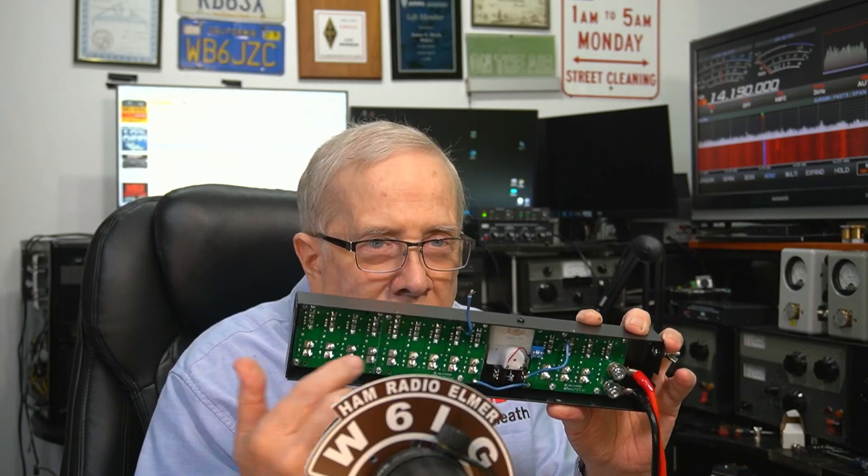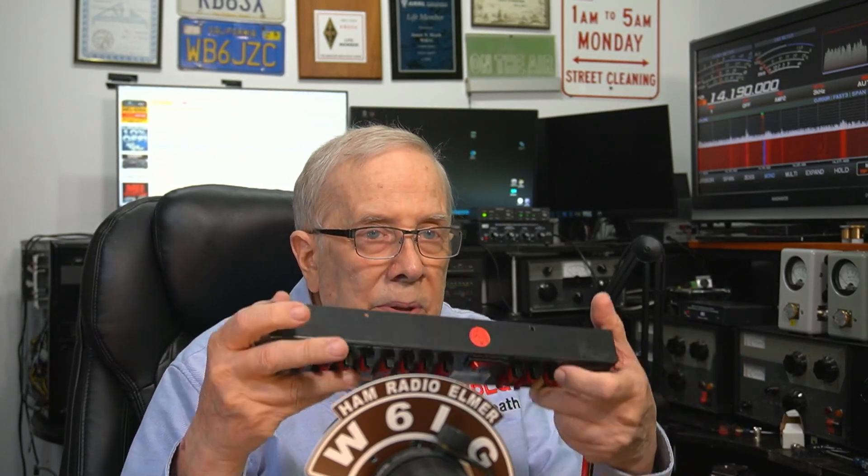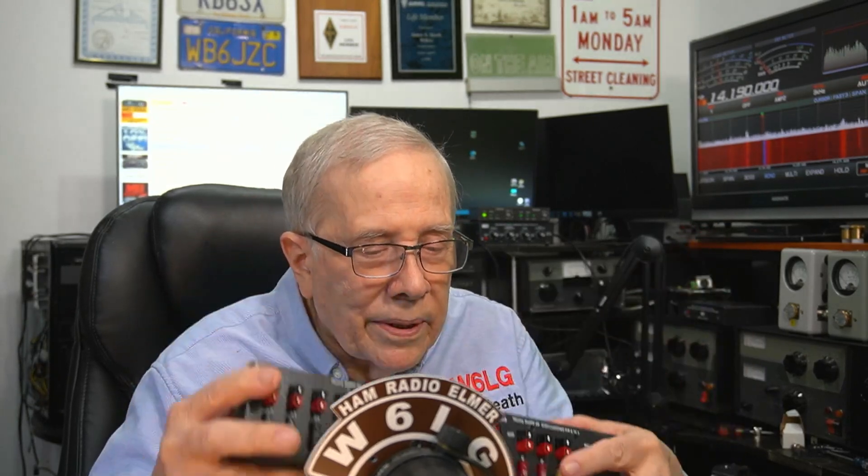So it not only was a cold solder joint, it wasn't soldered at all. The bottom one is the negative rail, and I think the box and everything is all tied to ground, so that one I'm not worried about. The other wire over here on the second half of the switch — it's a single pole double throw switch and they've picked up just half of it. That wire is also loose. Notice there's a quality assurance sticker on there with a couple of signatures of people who didn't do their job.